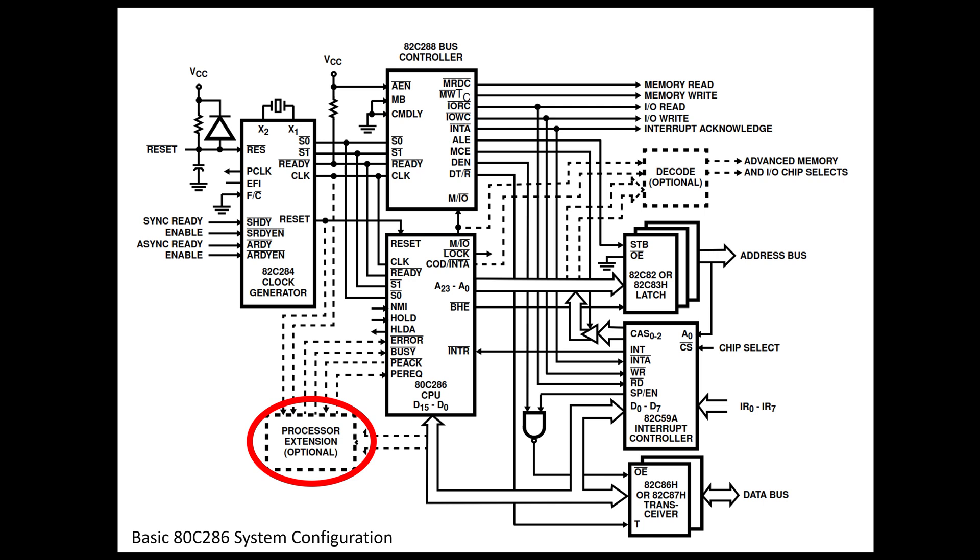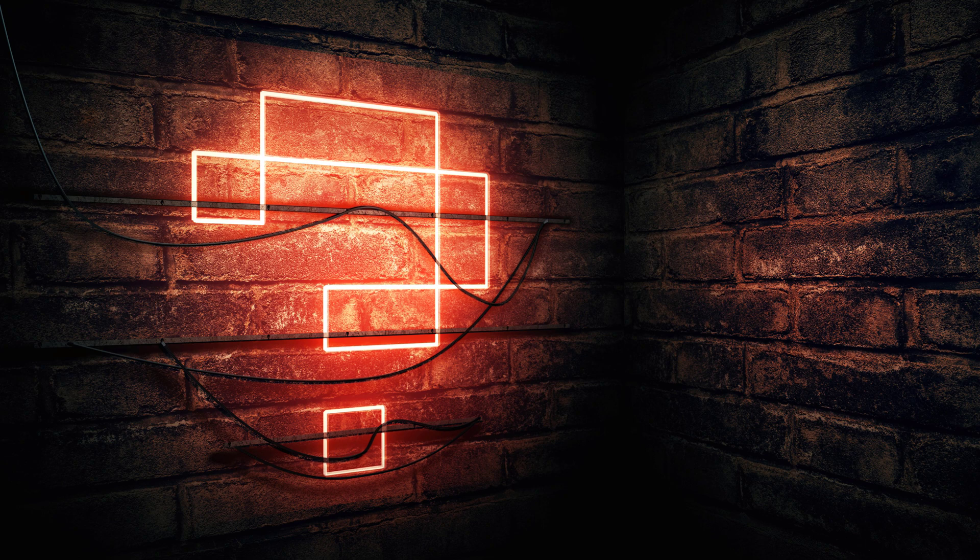Later I'll actually connect it, wire it up on the breadboard, and then further after that, I'll get to figuring out how to work with it from an assembly perspective. You'll see there are some similarities - I can basically modify the behavior of the 287 coprocessor by writing to it through an I/O port, much like we saw in the last video with the interrupt controller. I have plenty of questions and don't have a full understanding of everything yet, but I'm getting some comfort for how it's going to connect up. The assembly part I'll have work to do later.